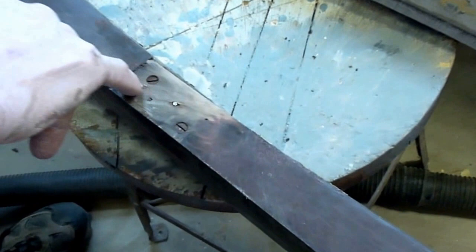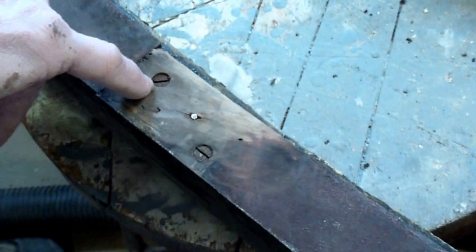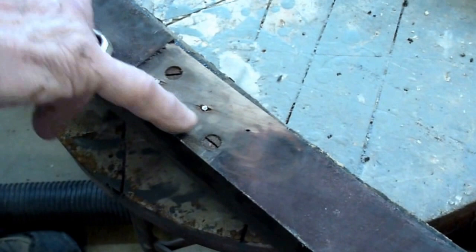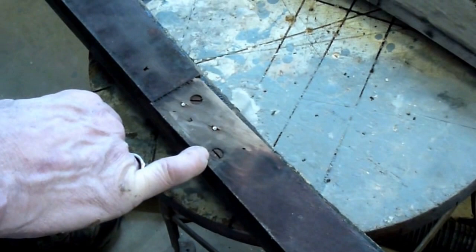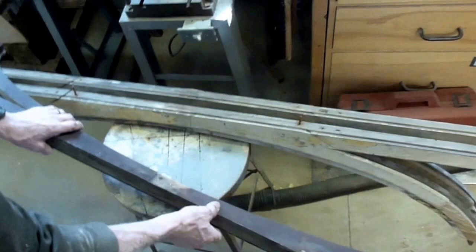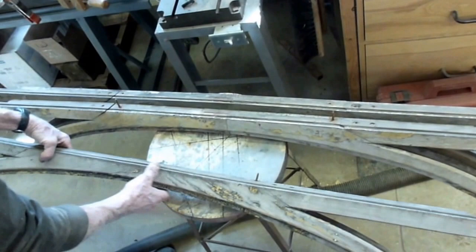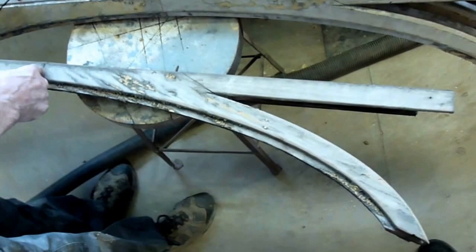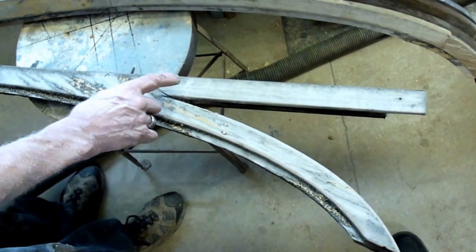You can see a couple of them here — looks like nails, maybe screws that were cut off to get them out. They're screwed together, so I'll dig these screws out. These usually back out because they've been covered up and haven't had as much weather exposure, so probably these will come out. What I do is clean out the slot very carefully, then use a screwdriver bit in an old-fashioned bit brace, which gives me a lot of torque. If I rock them back and forth, sometimes they'll just come right out. Sometimes they snap off, or the head snaps off. Once they're out, the unit separates into two halves. This is the piece we just cut out and shaped — it was built with a tail that went along the top, and that edge board went down and sat in the groove.